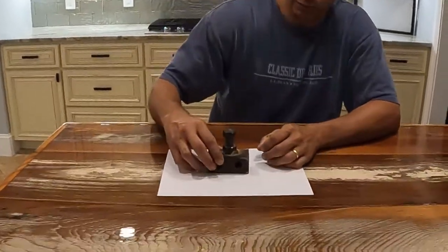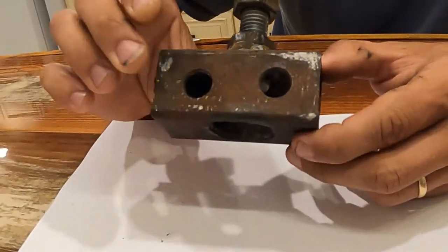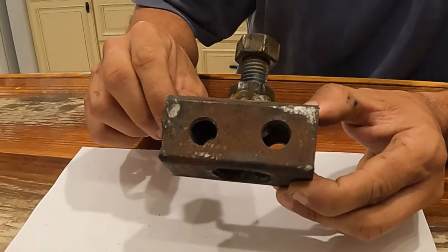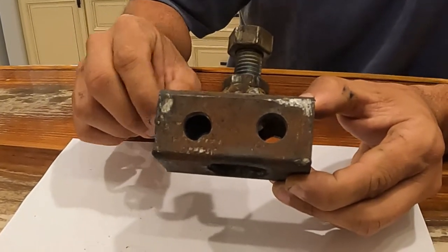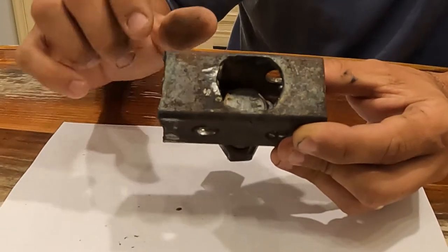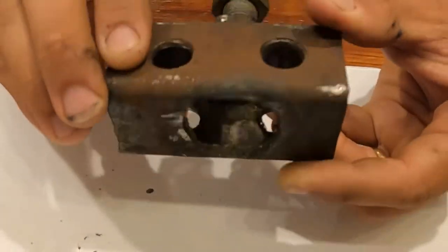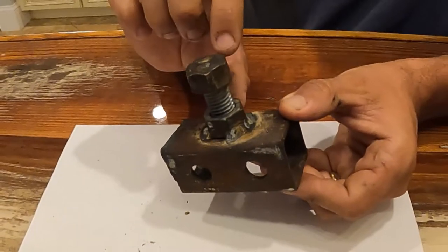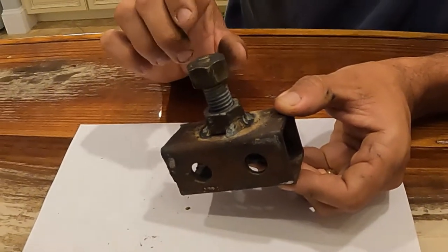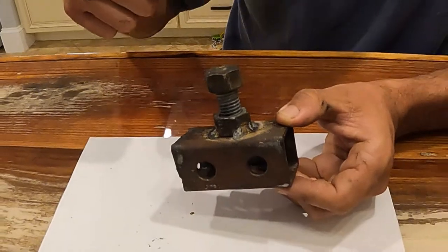So this is kind of what we did: we just took a piece of inch-and-a-half square tubing and drilled a couple of holes in it to line up with the holes in the bracket on the anchor. Then I burned a hole in the bottom with the acetylene torch, inserted a half-inch bolt, welded it to the inside, and then welded two nuts to it.